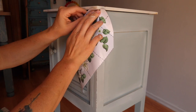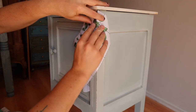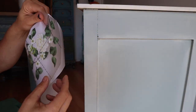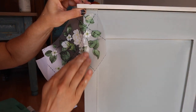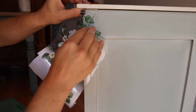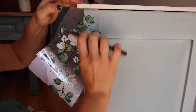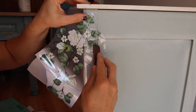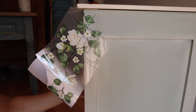This is going to go around that 90-degree angle and it's going to be on multi-levels. So I'm going to cut it, look at it, and see if it's exactly where I want it. Then I'm going to peel that white protective backing off and gently place it on the piece of furniture. I'm going to work on the right side first — put it on the crease and then gently burnish it down on the side because we're going to work our way around that angle. I'll take the burnishing stick that it comes with and burnish that side very carefully. Make sure you're not touching the other side because the sticky is meant to stick on the piece of furniture, not your hands — so don't touch the other side of that plastic.